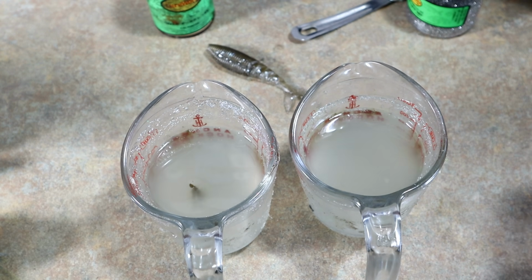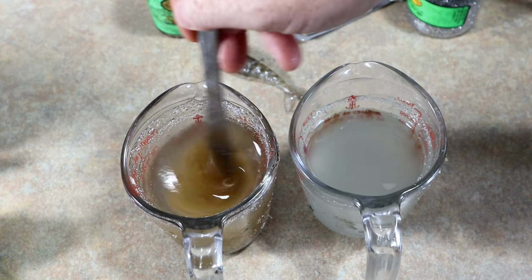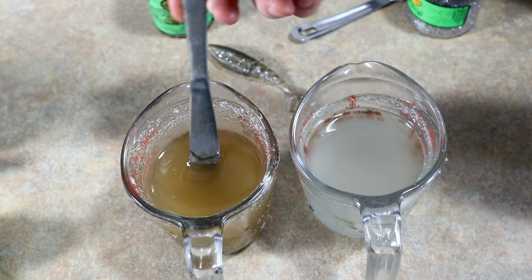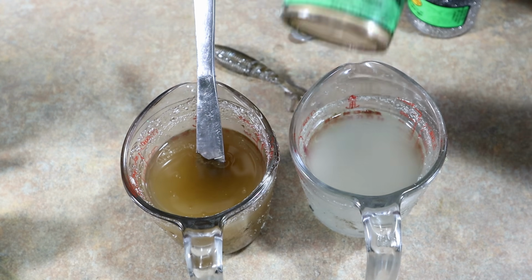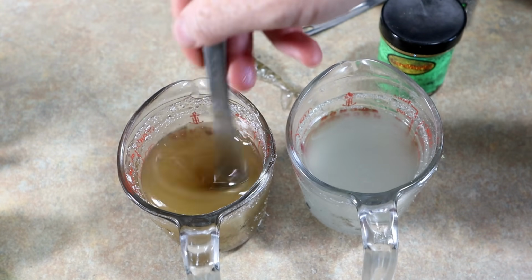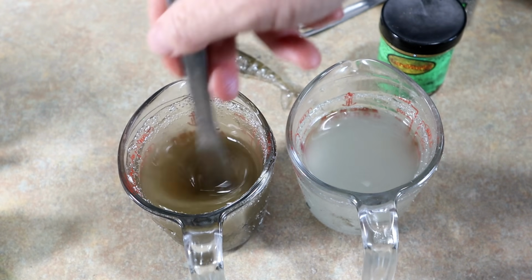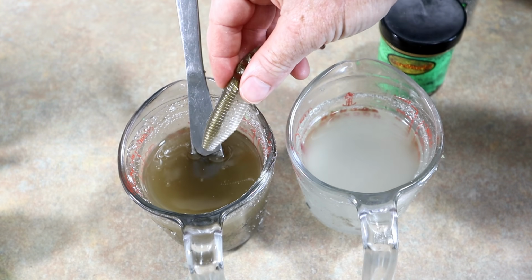And we might need to darken it with some black, or I'm not sure, and then we're gonna add some gold pearl to it. Yeah, we're definitely gonna darken it. So we're gonna start there, but then darken it with a drop of black, then add some gold pearl to it and see if we can get it looking close. All right, there's our drop of black. Let's get that mixed in, and that will change the whole thing. Look at that, beautiful. All right, much closer there.